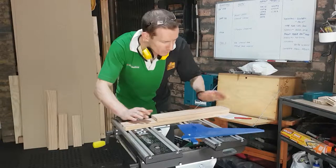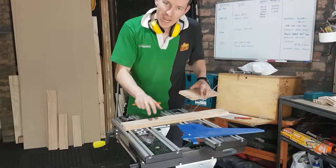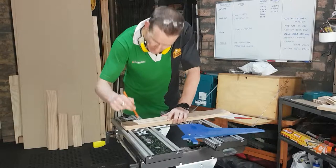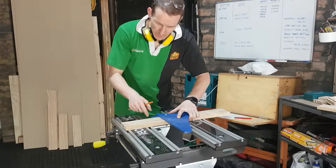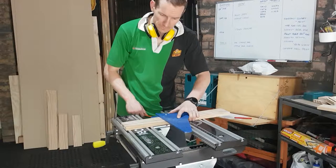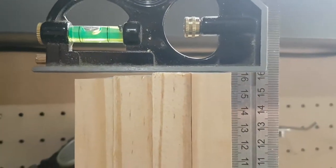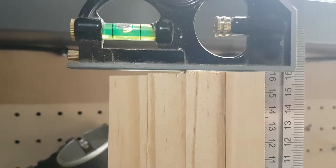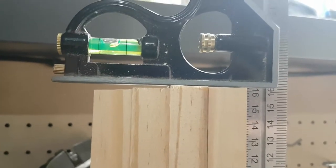The mistake I was making is: after I've lined this up and marked it off, I was cutting on the wrong side of the line. The way to ensure an accurate cut is to always position your blade on the off-cut side. So in this case, I put the line there on that side of it, and now the blade will run along here and not along here, which was giving me the shorter distance. Here's a view with a square on there just to show you how much I'm out — it looks to be a variation of two to three millimeters from the highest to the lowest. So with the circular saw and the square cut it is tricky, though I was getting better at getting accurate cuts.